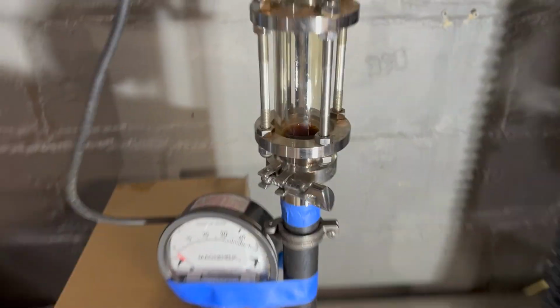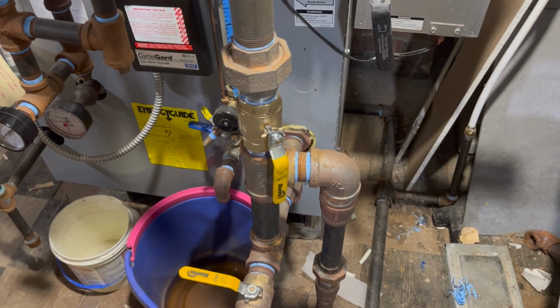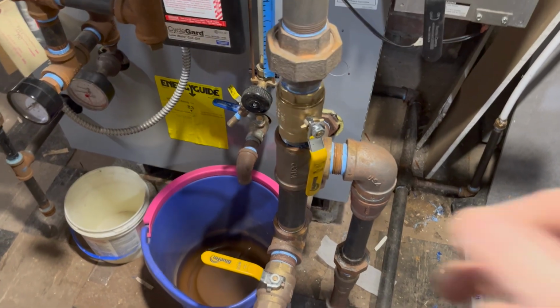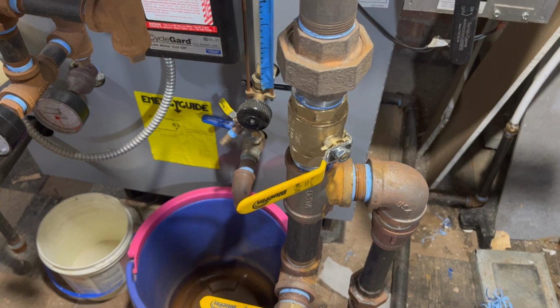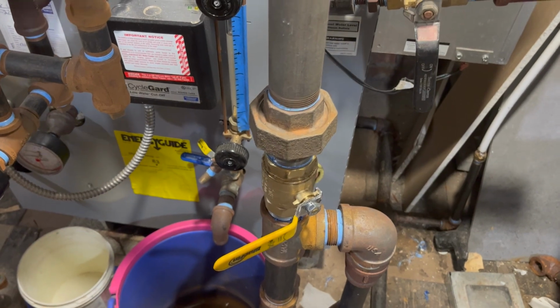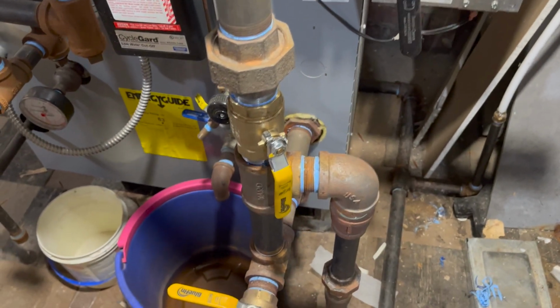But the idea is, when I separate off the equalizer, according to the theory that the equalizer is preventing the water from getting pushed backwards out of the boiler, if I turn this off, I would think people would expect that that is going to rise here, because the equalizer is no longer doing its job, right? Now, according to my drawings, that wouldn't happen, but I can't get anyone to say, yes, your drawings are right, with very few exceptions. They won't say my drawings are wrong either. They're just not commenting on my drawings, which is fine. They're just drawings. But this will be a real experiment.